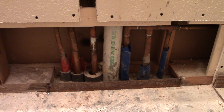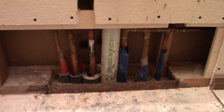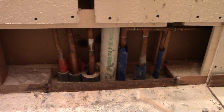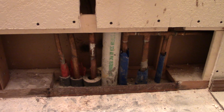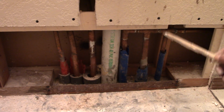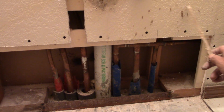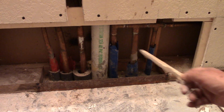Yeah, you have to consider all the people that are going to come and visit. You got your carpenter who's going to come in here, put in this wood, and then you got to hire a drywaller who's going to come in here and put drywall in. And you're going to have to paint it later on too. And then you're going to have to hire a painter. Of course, they're going to want to texture this. This new piece will be bare naked, and I'm going to want to texture it so it looks like this, kind of spattered orange peel. And I have the tool for that, so I'm going to spatter this new one.